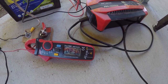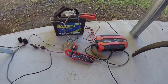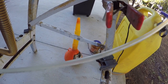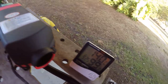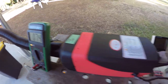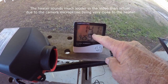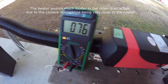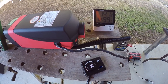The heater is firing up, the glow plug has turned off, and the amp draw has dropped to about two and a half amps. You can see the little cavitation bubbles coming through the fuel line. The outlet temperature is starting to increase — what we're interested in is not the absolute temperature but the increase from the ambient temperature to what's coming out at the end of the pipe. I'll let it settle a bit more.